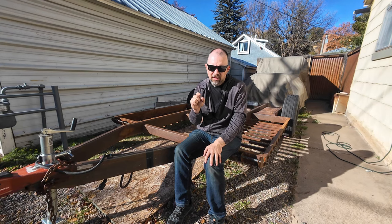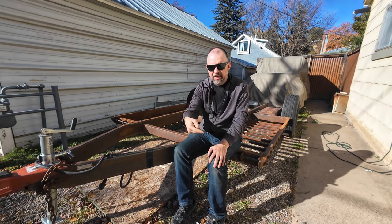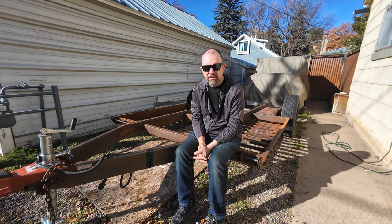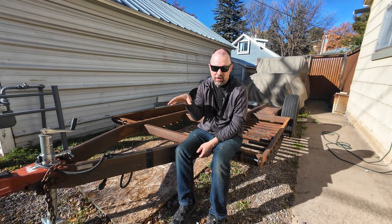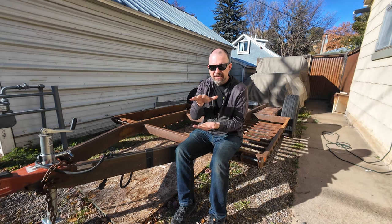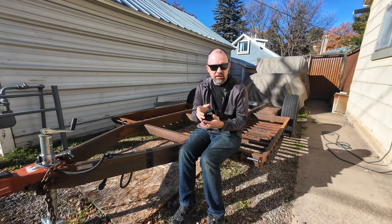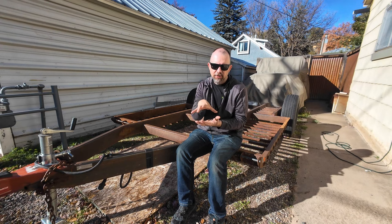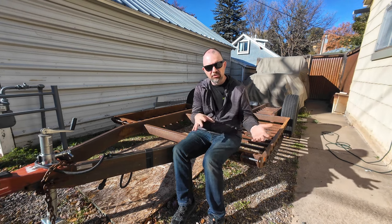I do commonly strap from the rungs, I'll call them, of the ladder where you drive, and I go up and over the tire in all four tires. And so I am always strapping to the tire, letting the suspension of the vehicle work as the damper. So with no suspension on the trailer, the vehicle acts as the damper, and you can think of it generally as sprung unsprung weight in a typical vehicle. It's just on a larger scale. So that allows the trailer to be damped by the full suspension of the vehicle, including the shocks and all the things that trailers don't normally have.